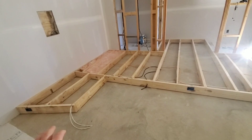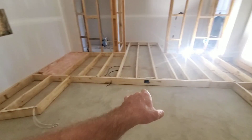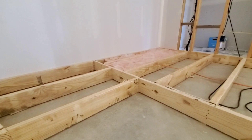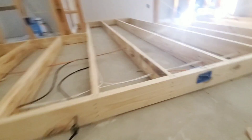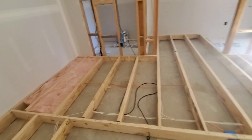On concrete you cannot have non-treated wood, so I got some treated lumber and cut some quarter-inch strips — I've got everything lifted up a quarter inch with liquid nails just kind of holding everything in place. Everything is suspended a quarter inch off the concrete. The floor is not perfectly level so this was actually helpful — we could level the floor by doing that, which made it even better than it was.